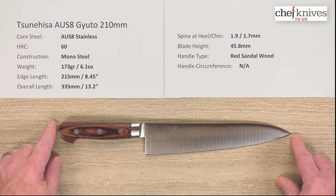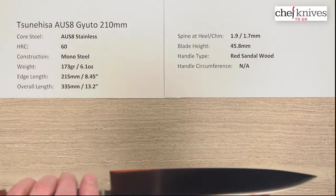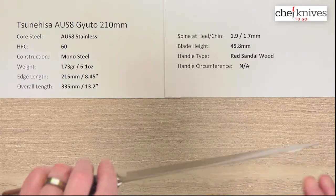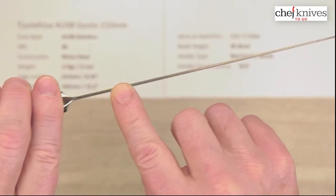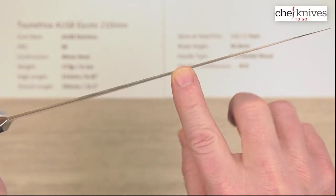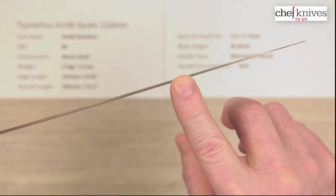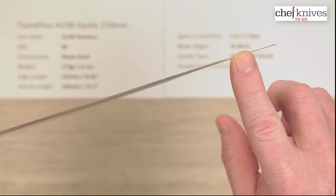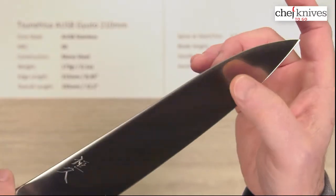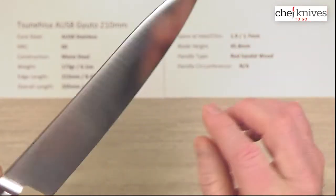Overall length is about 335 millimeters from the tip to the back of the handle. Thickness-wise, this has a little bit of taper to it — it's a nicely made knife. I got about 1.9 millimeters of thickness at the back and then about 1.7 in the middle. And it does have a distal taper, where the spine thickness gradually gets smaller towards the tip. And then we've got the overall grind of the blade that flows from the spine down to the edge.